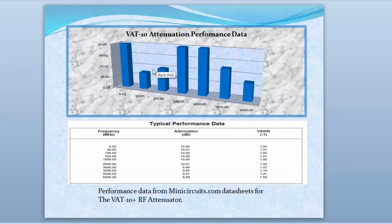This is the Mini-Circuits 10 dB attenuator. At its lowest point it's like 10.01, and at the worst case it was like 10.06 — so basically 0.05 dB variance or flatness across the span we were working with. Very, very low, very, very flat. It provided a good model to verify by, to make sure that our test setup with the two 6 dB attenuators was really performing the way we believed it was.